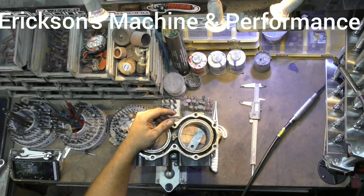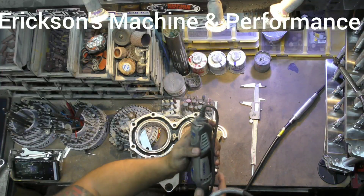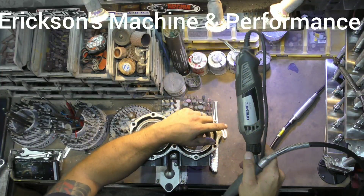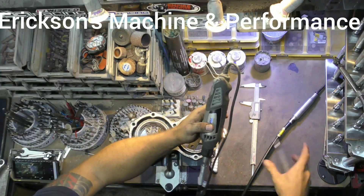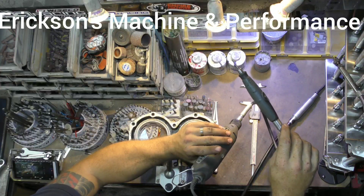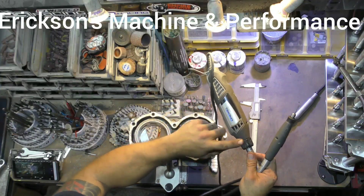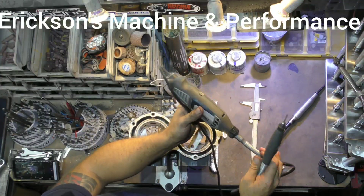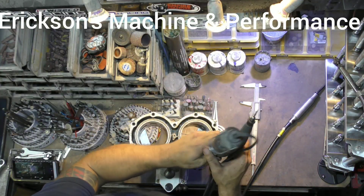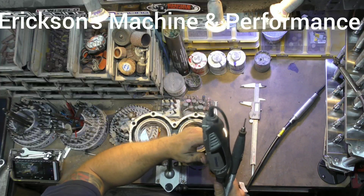If you want to go away from air, you can go electric. The cheapest electric option really ends up being the Dremel. I recommend if you go this route, get the Dremel 4000, and make sure you get the shaft grinder extension kit they sell for it. If you use the shaft kit, these things really last a long time because the shaft puts flex in the system and you don't beat the grinder up as much. If you don't use it, one, it's really hard to get into the areas you need, and two, you'll wear out the grinder extremely quickly.